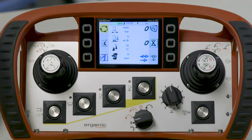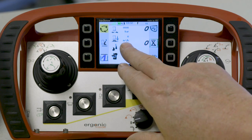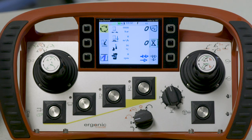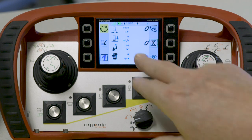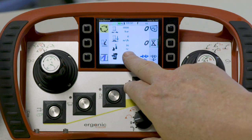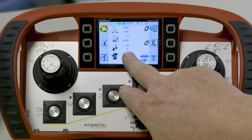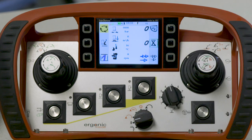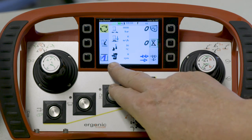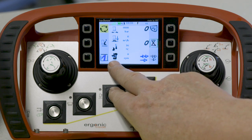The next one down is our pump speed. As we run our volume control dial up and down, the speed changes, and the speed in meters per hour will be displayed here. We can also change all of this from metric to standard — if you prefer PSI, yards per hour, and Fahrenheit, that's on another screen. It also shows hydraulic oil temperature — right now at 16 Celsius, which is why there's a little caution indicating the oil is a little cool and wouldn't pump at full speed yet. Our RPM is also shown here.